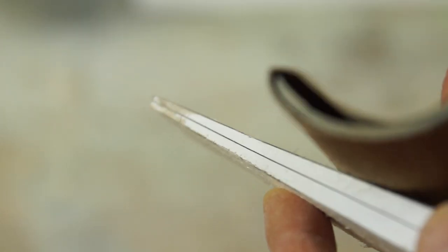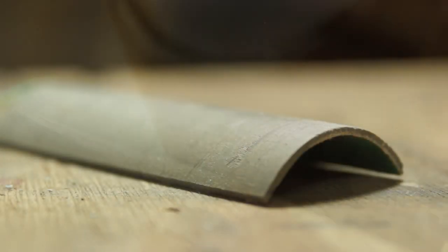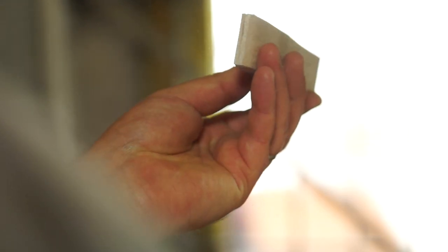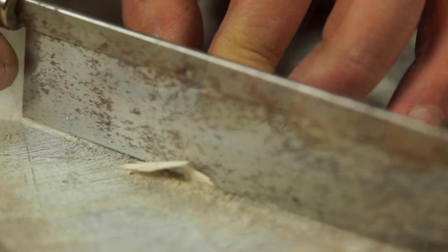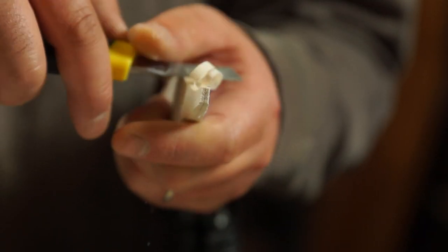Where the body tapers towards the tail it actually curves in slightly, and to sand there I'm using some paper wrapped around a piece of plastic cut from a piece of drain pipe. I'm really checking for squareness as I work. For the sides I can repeat the process using the other template and sawing as close as I can, then again using the sanding block for external curves. On the internal curve I'm using a craft knife to get rid of the bulk of the material, then back with the drain pipe piece to tidy things up.